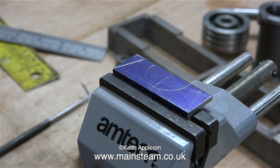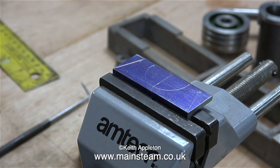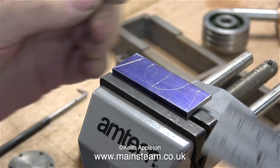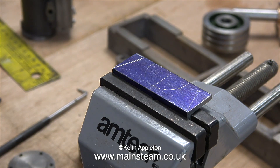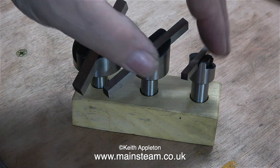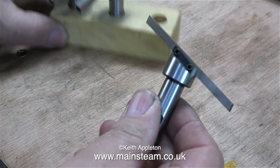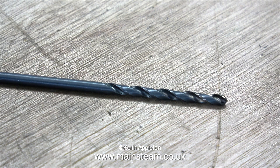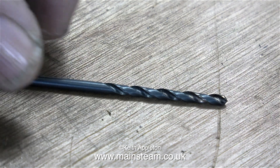Now for the big question: what's the best way to cut out the semicircular piece that sits right in the center of the steel angle? I could do it on the bandsaw with plunge cuts and file them to shape, or use the milling machine with a one-inch diameter milling cutter, or use a set of fly cutters set to cut a neat one-inch diameter hole. I chose to use a twist drill — it requires a minimum of setup time, and in the next episode I'll show you what I did with it.